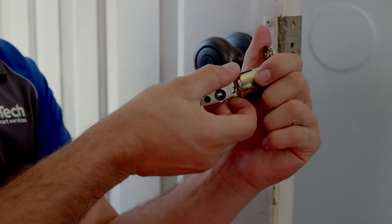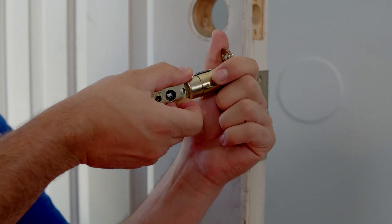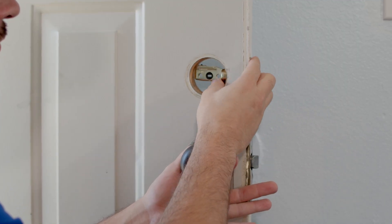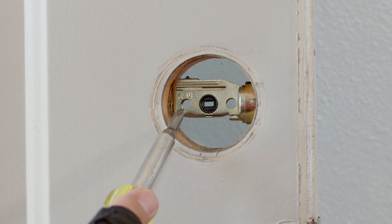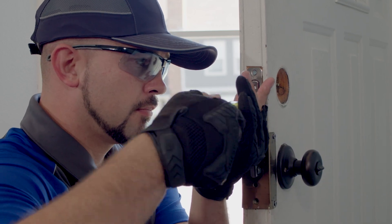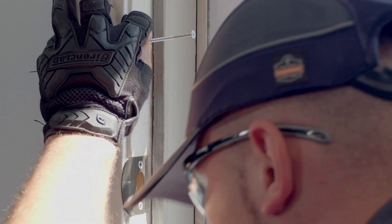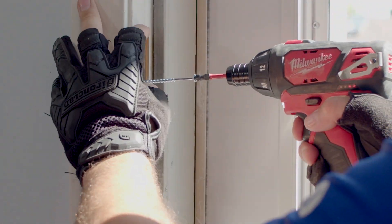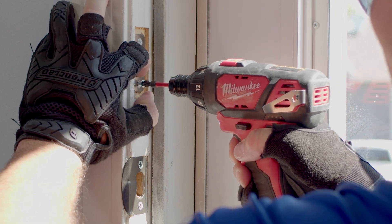Adjust the lock's deadbolt length so it fits in the door with the bolt retracted. Install the deadbolt in the door using the included screws. Ensure the arrow on the deadbolt is pointed up, then install the strike plate on the door frame. The new plate included in your lock is engineered precisely to fit the Nest Yale lock, so you'll need to install the new one even if your current strike plate looks the same.